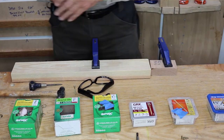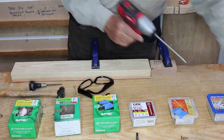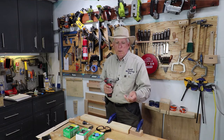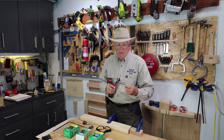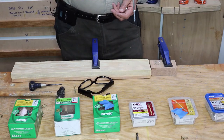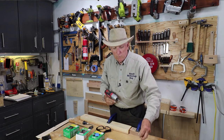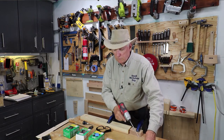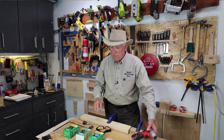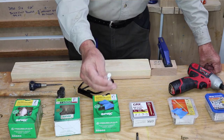To start our discussion on wood screws, let's make our Canadian friends happy and talk about the Robertson first. The Robertson — you'd be familiar with the Kreg pocket hole jigs — has a Robertson square head on it, so you have to have a square bit. An advantage is that they fit very nicely and don't drop off. That's the Robertson, the square head, which is primarily what everyone in Canada uses.